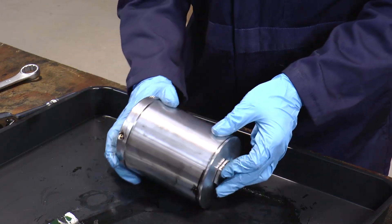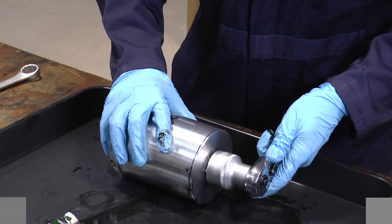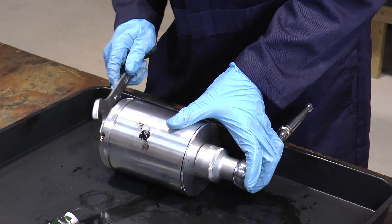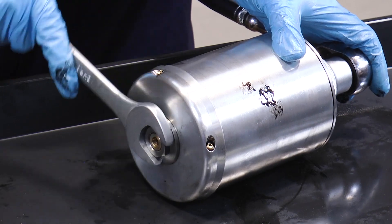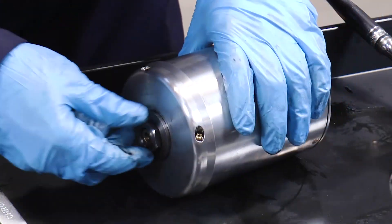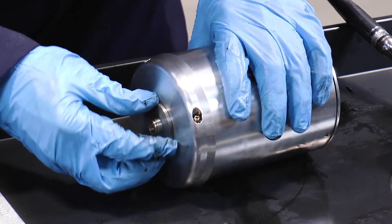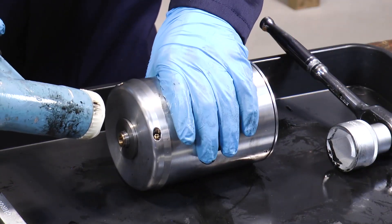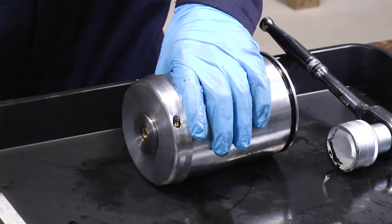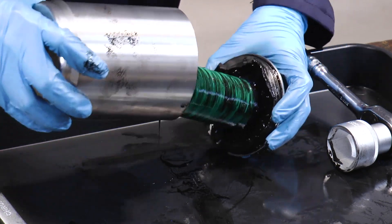First thing to do is to lie the bowl assembly down and get your spanners. Now the MP90 has a right-hand thread, so untighten to remove using the spanner and untighten the cover nut. Remove the cover nut. If the washer doesn't come off, we can just take our mallet, hold on to the top of the bowl wall gently and tap the bearing tube until the distributor plate and bowl discs come apart.